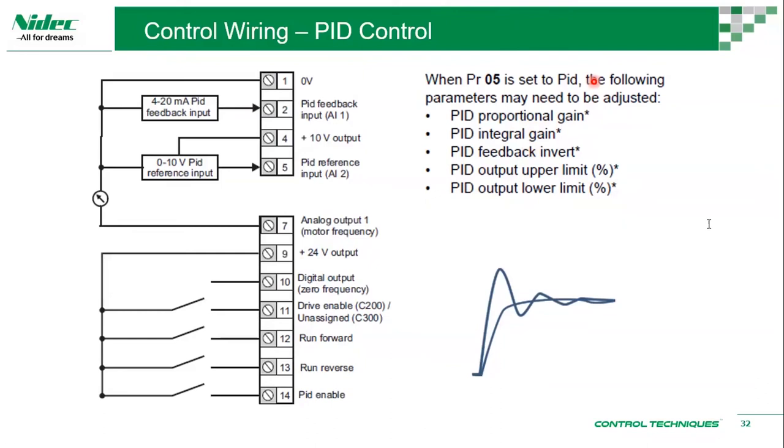Okay. Without earthing, it will get affected. If you do not have earthing on a VFD, it can go haywire. There could be a lot of noise, and all those noises would not be earthed. Even your control cables need to be earthed. So it's basically noise protection, and then another is earth fault protection. So you don't get that if you don't connect earth.